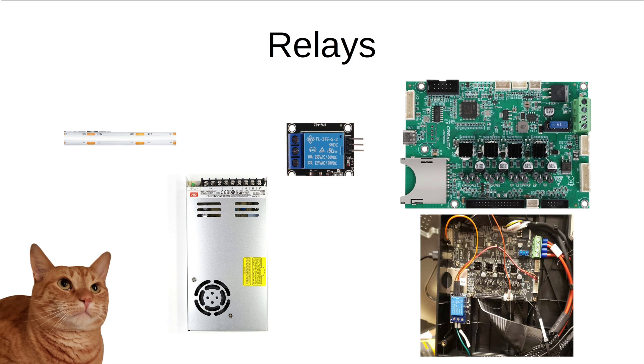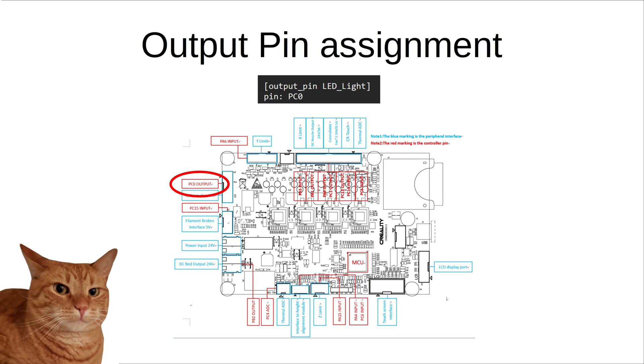Once that was all figured out, I connected the G from the relay to the ground on the LED section of the board, the S to the output signal on PC0, and the 5-volt constant to the pin in the LCD section — which was the only source of 5-volt I was able to find. Due to using lighting that takes 24-volt DC, I connected the LED light's negative leg to a ground on the power supply, ran a 24-volt positive lead from the power supply to the relay COM input, and then connected the normally open pin to the positive leg of the LED light. This allows the light to turn on when the signal is triggered, causing the electromagnet inside the relay to engage. Going back to the schematic, we can see the output pin PC0 gets put into the printer config file using the output pin section.